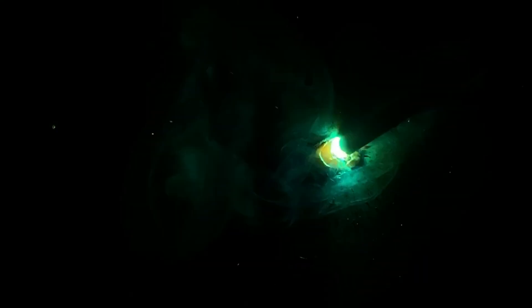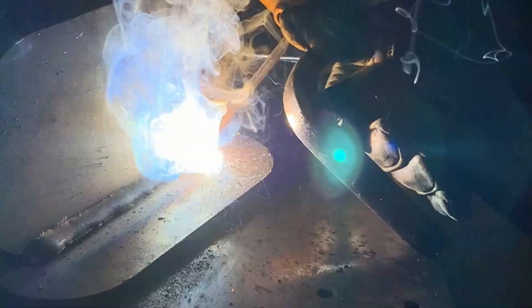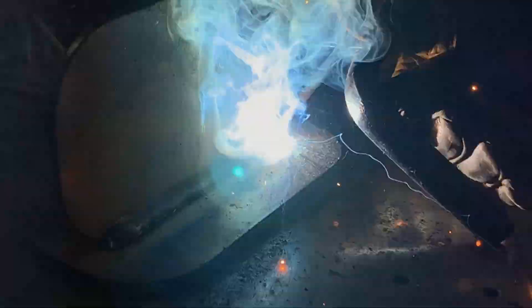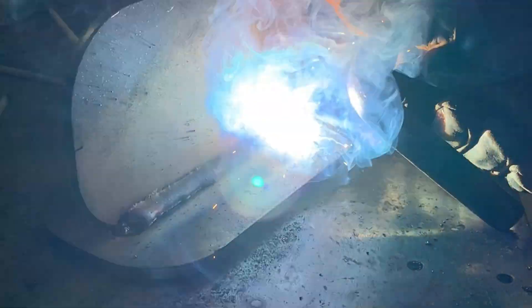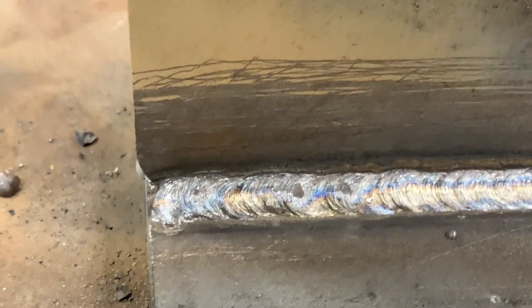The biggest problem with stick welding is having too long of an arc. Most of the time, if your settings are right, you should be able to just put that rod and almost rest it on the plate — take the weight off of the stinger. You can see the slag starting to peel off because we don't have undercut and we're going slow enough with a tight arc. It's really easy to chip off the slag and there are no big BBs.